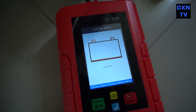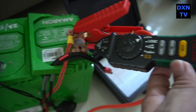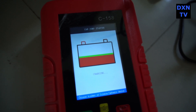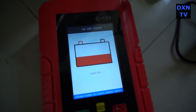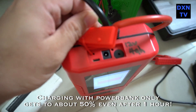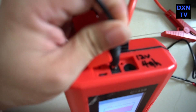What you're looking at is our demo to charge up the starter with a weak sealed-acid battery of about 9 volts. It will take about 10 to 15 minutes to charge it up, and it draws about 4 amps of power while doing so. We can also use a 5V power bank to energize it, but in my tests the unit never gets to 100% usable charge even after 1 hour.